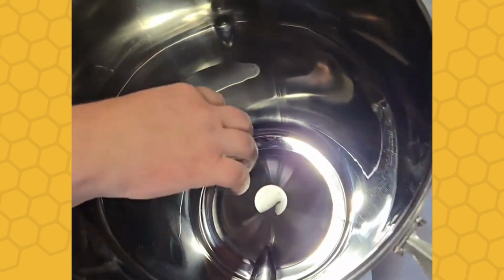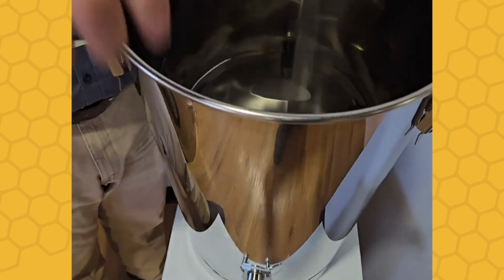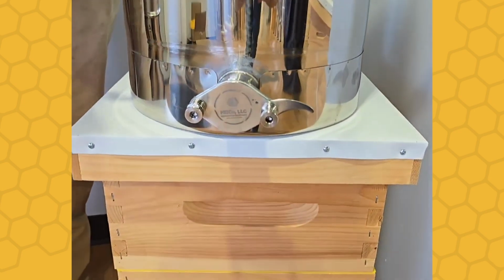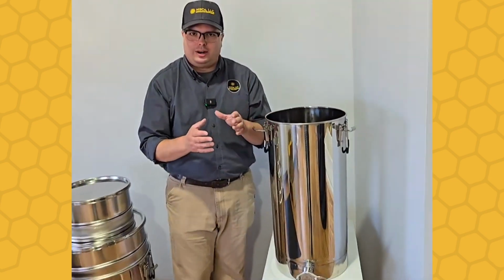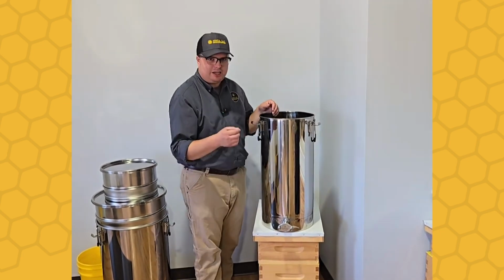You see a trough in there. So the honey gate is mounted below the surface, the floor of the tank, and a nice welded stainless steel gate, no obstruction in your tank. It just flows right out to your gate, no mess, no fuss, just the way it should be. I love these stainless steel honey gates. A welded stainless steel gate really, really works slick. It just opens and closes nice, a clean shut off.